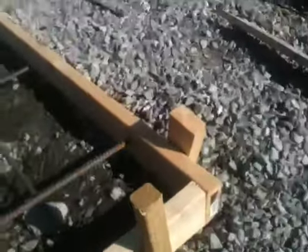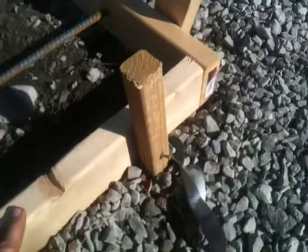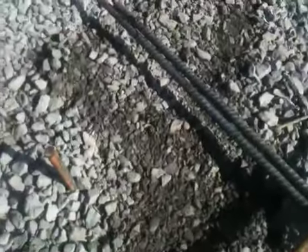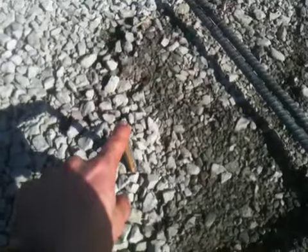The technique here is to level it with a transit, then stakes are put in — the corners are fixed at a particular height. The transit with an electronic eye works to get the level. A bobcat was used to smooth the gravel, then by hand with come-alongs. What you see here are rebar stakes poked into the ground — this is the method for setting the exact height. These are exactly measured with a transit, set to be exactly even with the top surface of the concrete, allowing you to achieve a perfectly smooth surface. They're placed on about 7-foot centers throughout the whole pad to get the proper level.